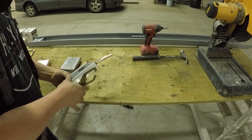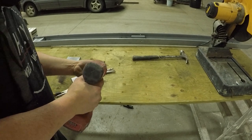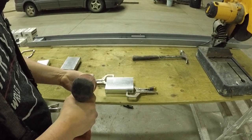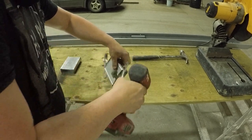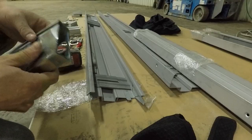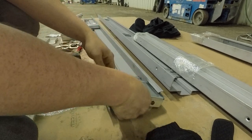Okay, because there's a 3/4 inch lip, 3/4 of an inch of flanges on those, 3/8 either side. There's a 3/8 flange, so that the clip has to snugly go into the outside of the casing. So for a 3 5/8 wall with 5/8 drywall, you want them to be 5 3/4 long. And I just put one screw in either side, obviously reverse from each other. The other trick is, see these sliding plates here? They have to be on top of those to be perfectly snug. They have to actually be right on top of those.